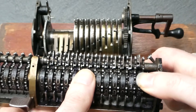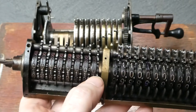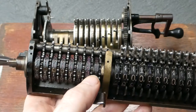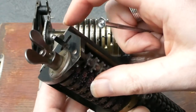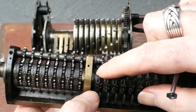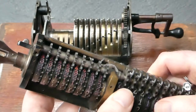The same goes if it goes from 0 to 9 when you're subtracting. The counter mechanism here does not have a carrying mechanism. It simply counts upwards in white digits or downwards in red digits counting the subtractions. It has a bell here — or it should have a bell here; this is the clapper — and this leftmost digit of the main register does not have a carry switch. Instead it pushes this bit that moves the lever, the clock lever.